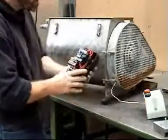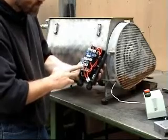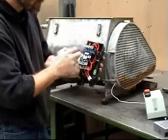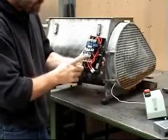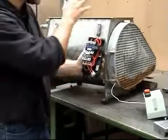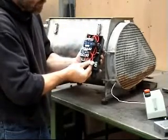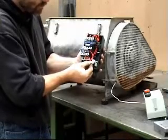The switch we're using is a direct online, a DOL switch. It's got a magnetic contactor, which is operated with the switches pressed. It's got an overload which has been matched to the motor, which is set, and it's got tags on it for our safety switch from our door guard, the lid guard and the belt guard. So hopefully that'll work okay and get that sorted out.